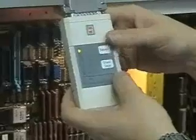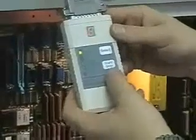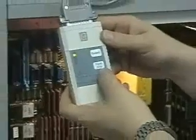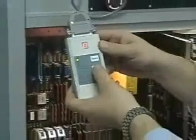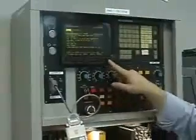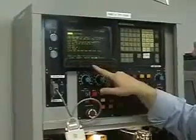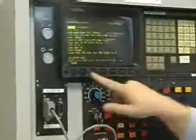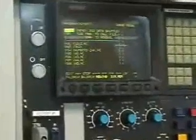Okay? So generally then, when you come up to a FANUC control or one that uses DC codes, you just power it on or hit reset and hit enter, and then go and use auto mode. And auto mode, of course, is, if I forward search for program 0, that's this program, and that's how you use it.